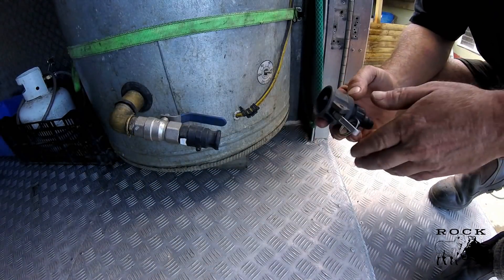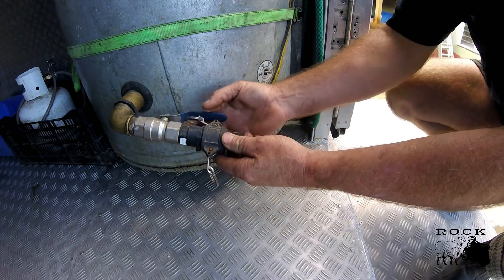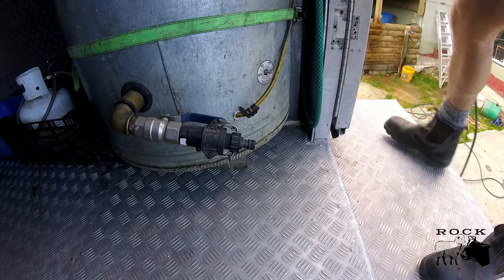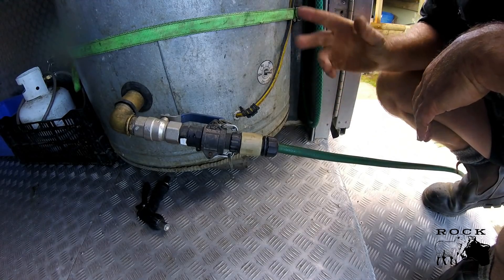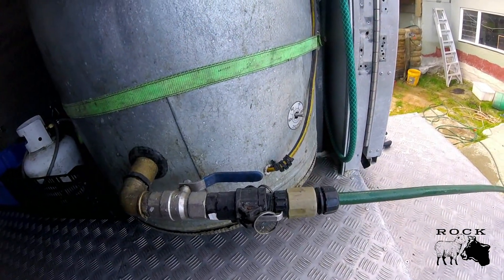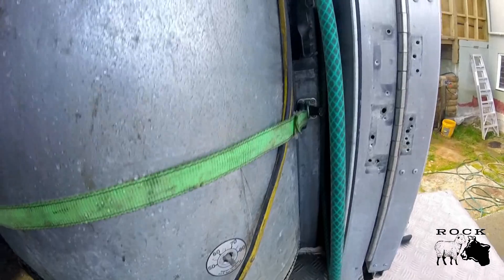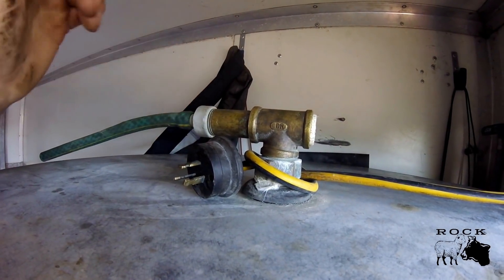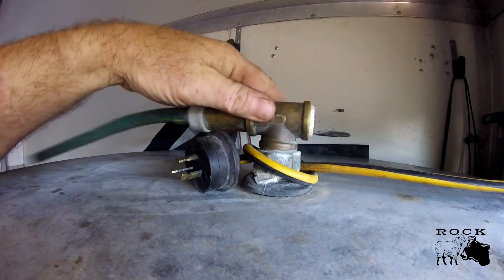When filling up I use quick water attachments with a normal garden hose fitting — put that on there, connect the garden hose, and that fills the hot water cylinder. While it's filling, you'll notice the electrical cord coming out with a thermostat. I put a flexible cord on it, run it up to the top of the cylinder, and put a three-pin plug on it. I plug that into my extension cord and it heats the water at night time — get up in the morning, unplug it, check that it's warm and I know it's going.